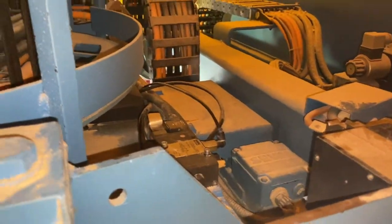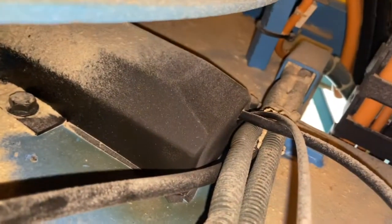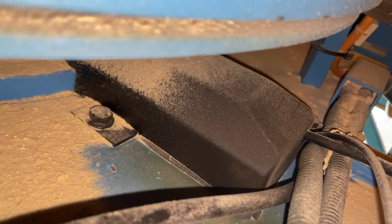You need to be up at the top of the saw so that you can see the pneumatic valve and be able to get underneath this black sheet metal cover. You can see it's held down by a 13 millimeter head bolt. You'll need to be able to get inside that cover to make any adjustments on the angle brake.